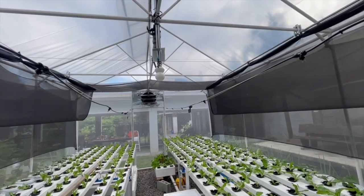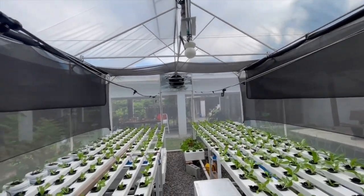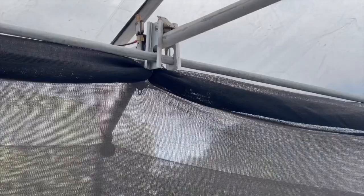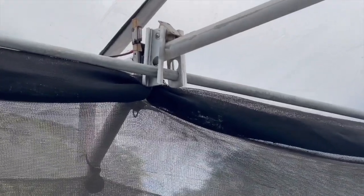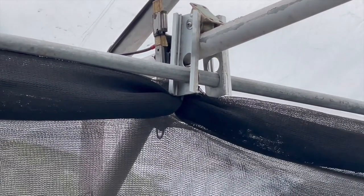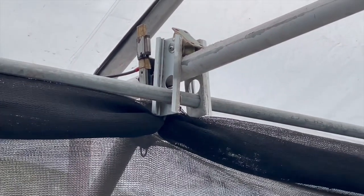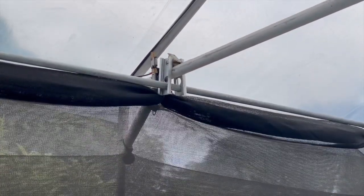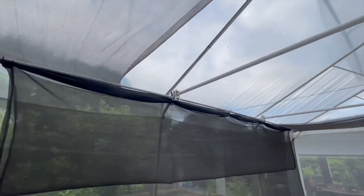I will try my best to show you the rest of the mechanical components in this greenhouse. At this part you will see the limit switch that stops the rotation of the motor when the GI pipe touches the extreme open position. This is necessary to signal the system to cut the power, thus protecting the motor and the cords.